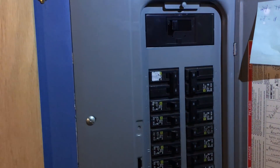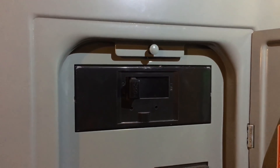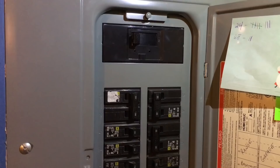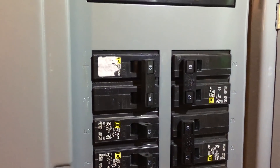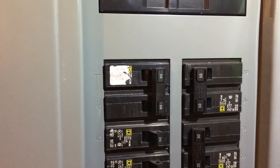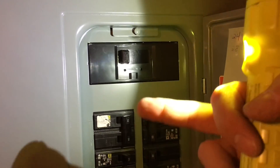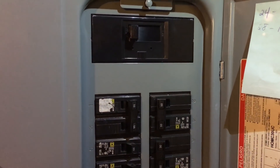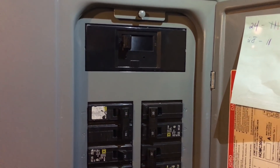Now that we've got lights, let me show you the switch panel in the basement. The main breaker up top is disconnected, so we are off the grid — even if utility power came back on, my generator power is not going back onto the grid. The generator wouldn't work if you did that anyway, and people could get hurt. This other breaker here is the one I engaged to activate my outlet. Check your jurisdiction if you're going to do this — some places require a metal slide gate that prevents you from turning this breaker on if the main is still on. It's a manual safety and not a bad idea.